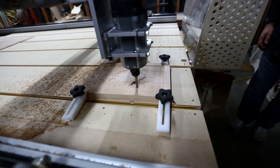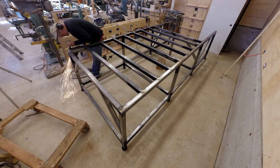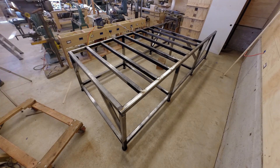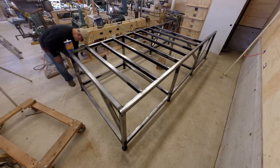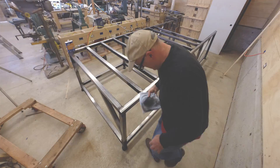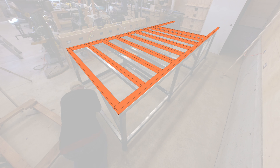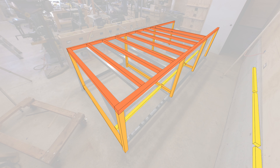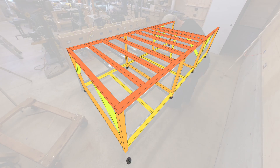Last year in 2014, in August, I started building the frame for my CNC machine. It really made sense to make the frame or base out of metal so that it won't expand with the different seasons, it'll be lighter to move if it ever needs to be moved, and it would just look nicer. I started with the top as a frame, trying to keep that as flat as possible, then made legs to hold the frame up, and then bracing to hold the legs in place, and some very cheap non-skid adjustable feet.